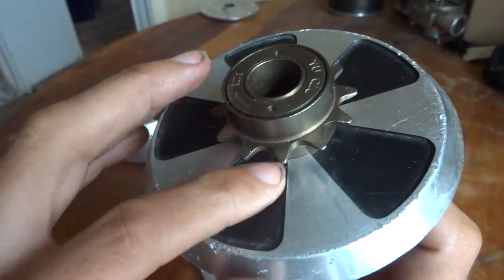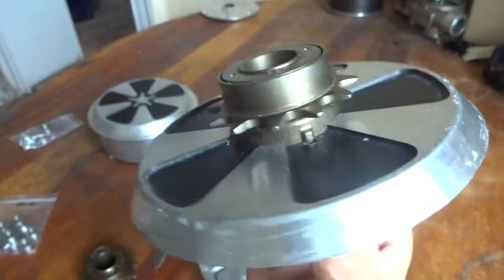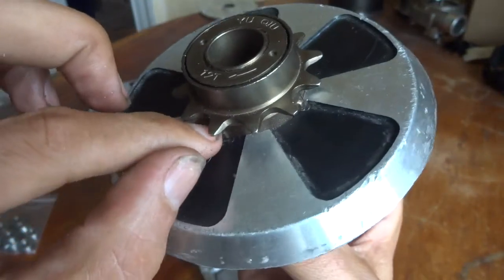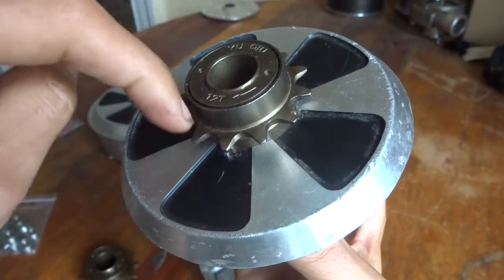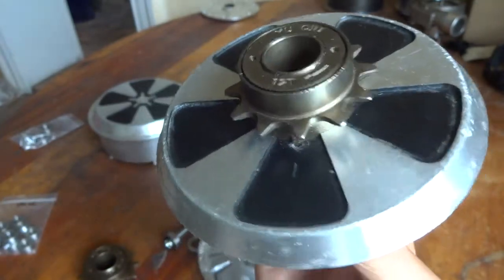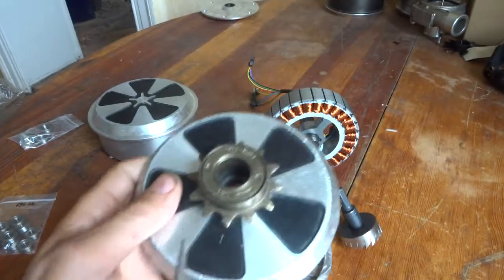The other two were right at the edge from the higher plate to the lower one. It was quite easy to define the position. I used a 2 millimeter bit to drill right at the edge — one millimeter in — so the 2 millimeter bit was right at the edge. Then I widened it with a 3 millimeter bit, and in the end took an iron file and widened it a bit more.